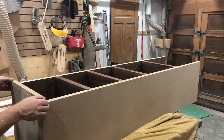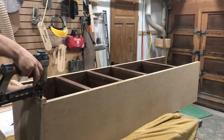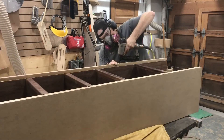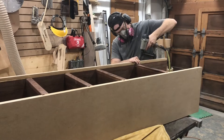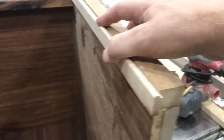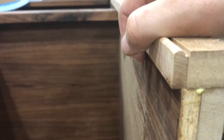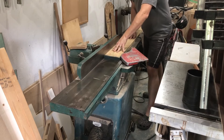Once those panels are dry, I'm putting trim on the front — just a one-inch MDF trim from off-cuts of MDF — putting it all the way around. I'm not doing 45-degree miters on the corners; they're just straight butt joints because it's going to be painted white and there's no reason to get fancy. There's also a piece of trim here that's going to cover the lip that I left intentionally to stop the trim piece I'll be making.